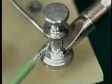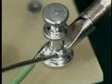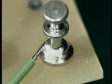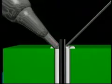The thermal mass of the tip becomes important when soldering to connection areas that will dissipate the applied heat. If other items such as tip length and contact area have been considered and still cannot compensate for the need for increased heat to the connection area, a tip with a greater thermal mass may prove to be effective. This will increase the ability to transfer heat without raising the temperature.